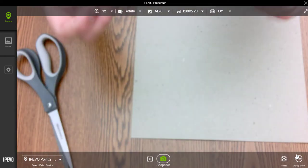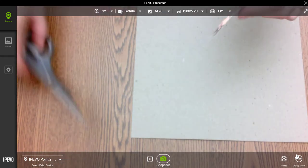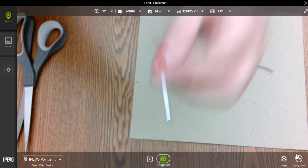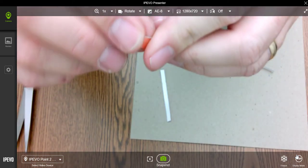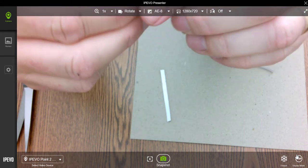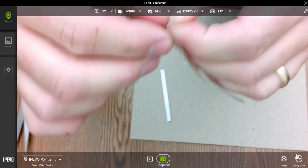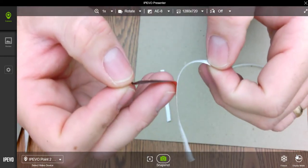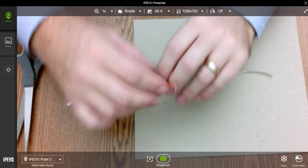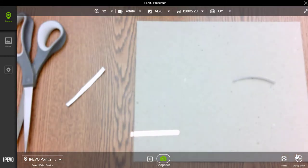You can see it has two sides: the copper side and a backing side. We're going to make a small little circuit, so I'll cut this into smaller pieces, peel the backing off — it takes a little back and forth to get it started, and it does tend to curl, so be careful. You may even want to put it on your paper like this, then go ahead and adhere it down.